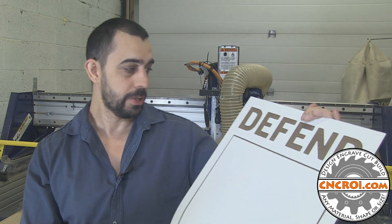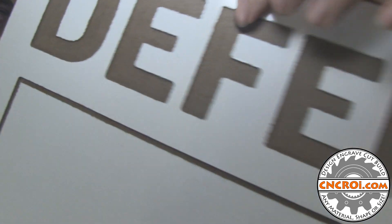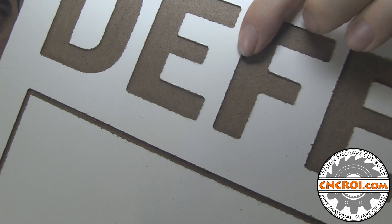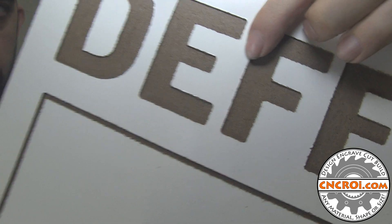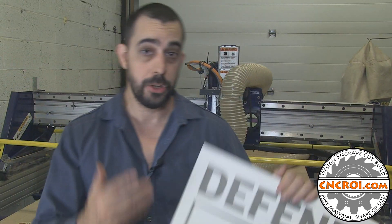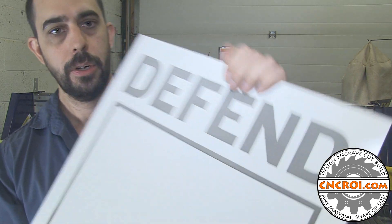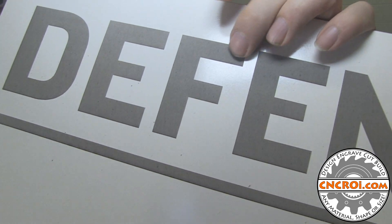The only other thing I want you to notice close up here is the chip-out. It might be a little bit hard to see, but you'll see the edges are a little bit rough. By contrast with the laser, which isn't a two-way feedback system — the laser doesn't know how deep it's going. It's just a rough calculation by me, the operator, as to how much power to use to get a certain amount of depth.